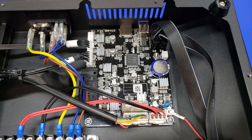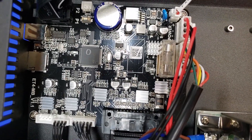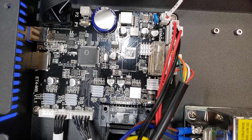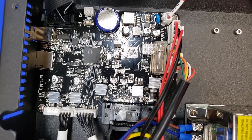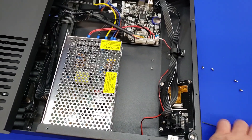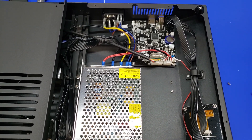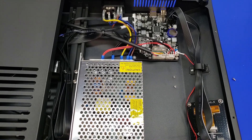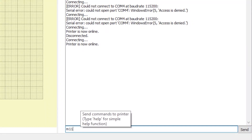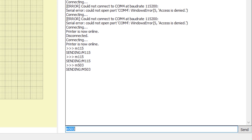Taking a quick look under the hood, we've got an STM32 processor — an ARM 32-bit processor, which is nice for speed. However, we also have soldered surface-mount drivers on this board, so there's no chance of upgrading the drivers. It's all proprietary cabling as well. I don't see anything here that would allow you to easily upgrade this printer — that proprietary mainboard and cabling means you'd have to literally rewire every connection. Using Pronterface, a quick check of M115 shows we're not using Marlin or RepRap firmware. I also tried M503 and saw no configuration settings, so this looks completely proprietary firmware.